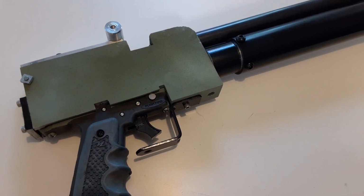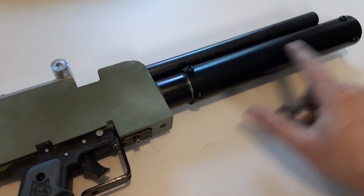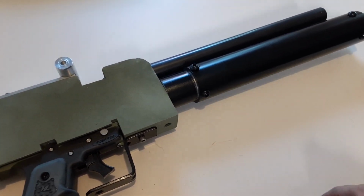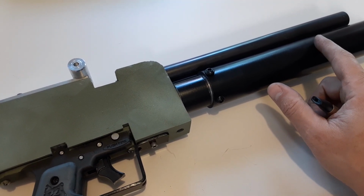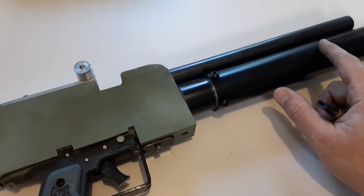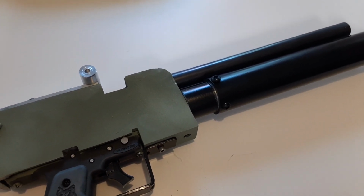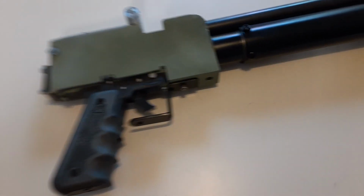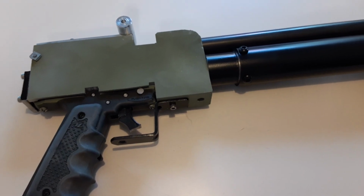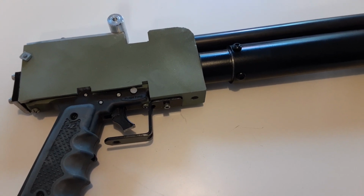If I had to do it over, I probably would have done a longer barrel, a balanced valve, a smaller air tube. I wouldn't need 260 cc's. I don't need a bunch of shots. I probably would have done just under 200 cc's, which would reduce the weight. Or I would have set it up originally for a tank and just had like a 13 cubic inch right here. And that would have kept it definitely lighter, and maybe a bit shorter. Yeah, if the block was made out of regular aluminum, I'd probably still be improving this thing. But it just got so aggravating.